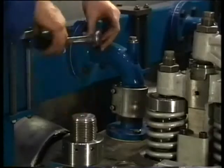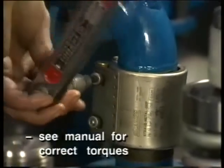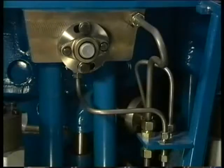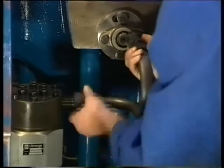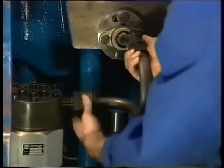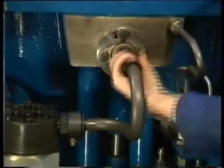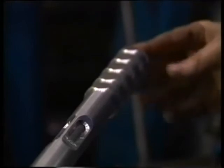Use a new gasket when the cooling water discharge pipe is mounted. The bolts of the rubber clamping piece are also tightened to a specific torque. Successively the pilot starting air pipe, lubrication oil supply pipe and the central drain pipe can be mounted at operating side. Remove the protecting cap of the fuel pressure insert in order to mount the high pressure fuel line. First tighten the union nut of the high pressure fuel line in the connection to the fuel pump, and after that the union nut on the insert. Both union nuts of the high pressure fuel line are tightened to a specific torque.